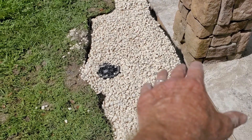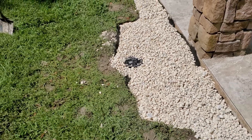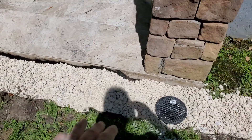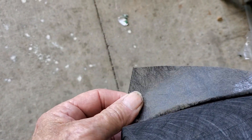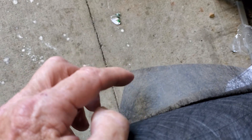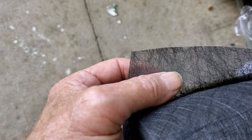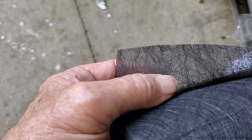So there are really two types of fabric that we use in our drainage systems. One allows water into the system extremely fast — I'll show you a clip of that — but the other is to help control erosion. You can see the voids; there are plenty of voids in here. This is not double punched, but there are plenty of voids to allow the groundwater into our system. What it does is slow down the water from going out of our system.